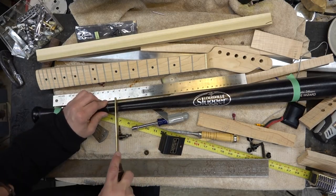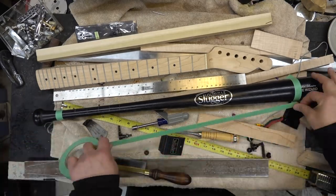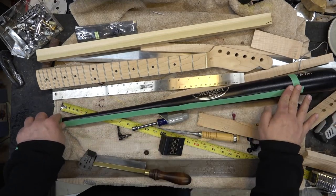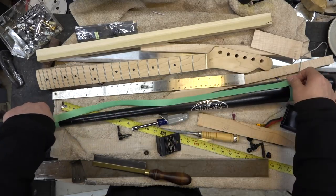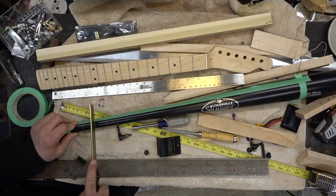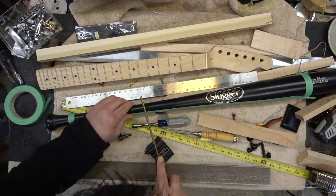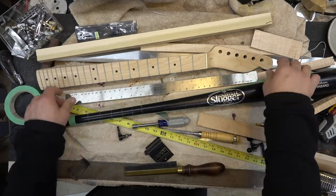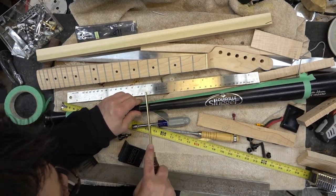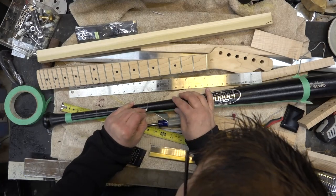This is made out of northern ash. What's cool at the Louisville Slugger factory is you can actually see them make the bats and how they do the finishing techniques — I learned a couple things from the factory tour. As I'm cutting the first couple of frets, I noticed I need a consistent look. So where I cut the frets, I want a consistent starting and ending point. This is going to be a 25 and a half inch scale like a Fender, and we'll just cut each fret just a little bit in, just enough to see the actual wood itself.